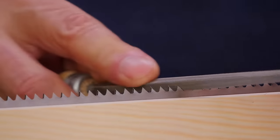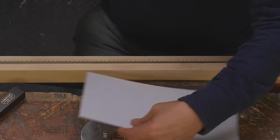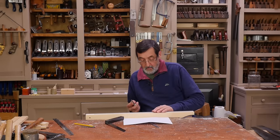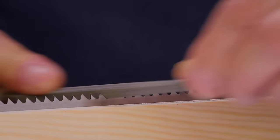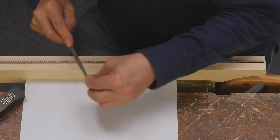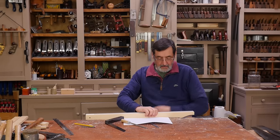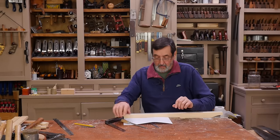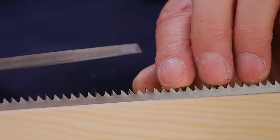I can feel myself drifting off a little bit, so I've corrected it. This is where the angle guide is really handy — right on the holder. I'm bringing this back into the main body of the vise because I can see it more clearly and it's more solid. When you've got a saw that's been used for a month or even a few days, the steel oxidizes on the teeth, so you can see from the new shine where you've finished and where you're starting again.